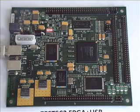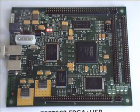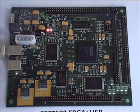3 interfaces are provided between the USB chip and the FPGA. All are accessible using the host library that's supplied with the board: streaming, data streaming at the maximum USB bandwidth; registers, control and status registers in the FPGA application; and signalling, single bit interrupts and flags.